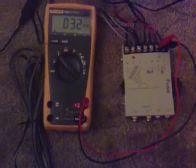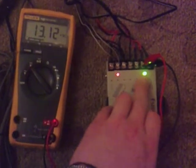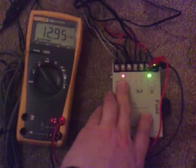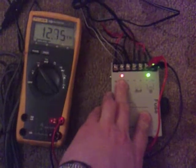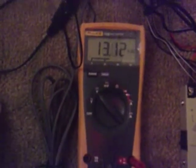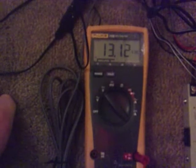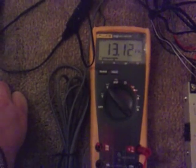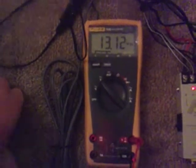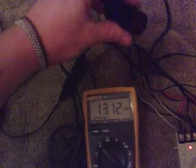I've got all them hooked up through the charge controller. I've got my solar charger here — if I switch this on, you'll notice the green light is saying we're getting decent power out, and the red light means it's charging. It's actually charging under room conditions with just the light we've got in the room. We've got a nice 13.12 volts across that. I've been using this to power my TV and lighting in my living room, and I've also got a normal car socket so you can run car appliances off it.